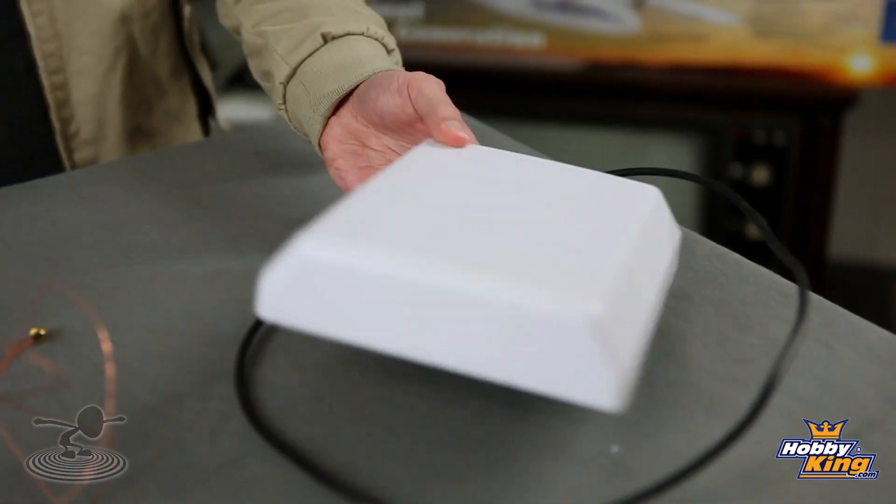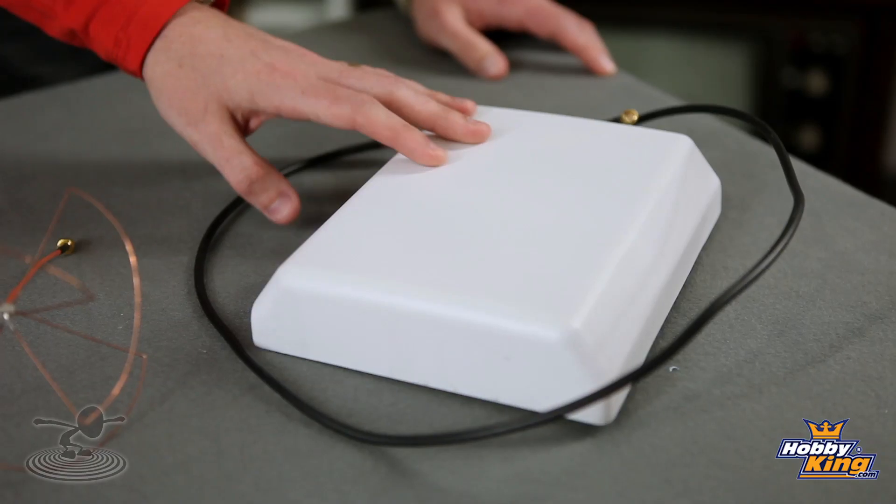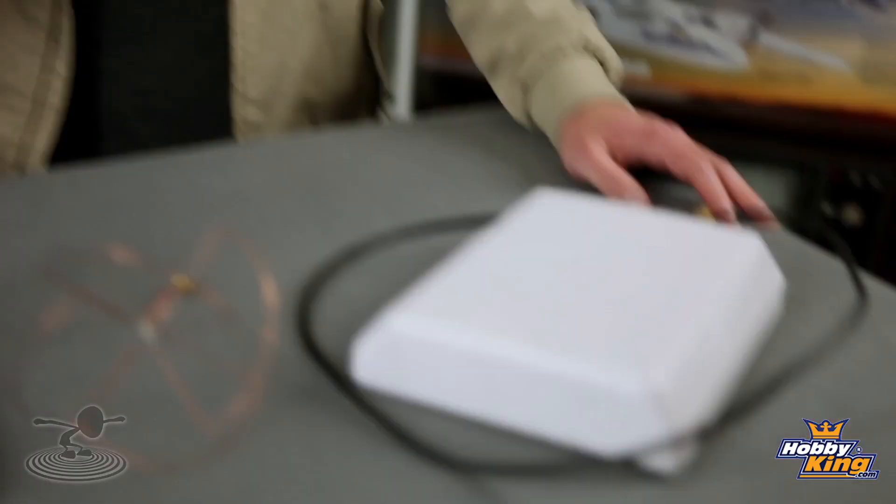And I see you brought your external hard drive as well — actually, it's a patch antenna. It's a linear polarized counterpart of these antennas, more or less. This is made for 2.4 gigahertz, and it's originally made for Wi-Fi systems. It's not as good as the antennas we use for our flying, but it's good enough. If you match that up with this antenna, you're going to get good range and good performance for the least amount of work. It is also directional — so you don't want to fly behind yourself. Keep in your reception area. When you come in to land, don't try to land behind you, because it'll cut out on you.